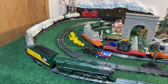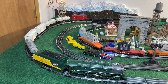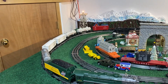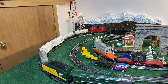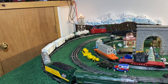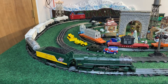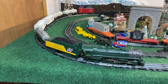Rather than deciding that was the death knell for this locomotive, I've done a couple of things on it. One of them was I put in a bridge rectifier. I took out all of the PS2 cards and put in a bridge rectifier that goes between the AC pickup and the motors, so it will run just fine — even though it's got DC motors in it, it runs fine on conventional power.